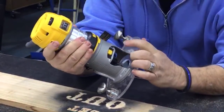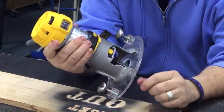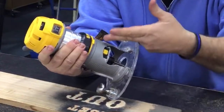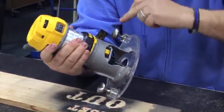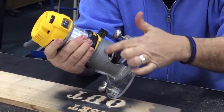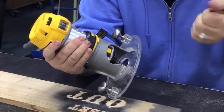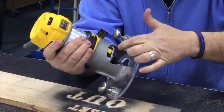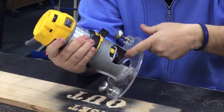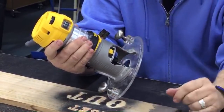A drill press with a metal saw, a hole saw. But you can do it, we actually have videos where you can just do it with a hacksaw too. Make 3 cuts, 1, 2, 3. Whether that's round or that curved surface. This was cut with a 2-inch hole saw on the drill press. Dad's got a jig set up for it. And then once that's out, you take this off and then use a hacksaw to cut that off. That's all there is to it. And then just kind of smooth it up.